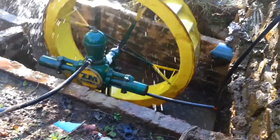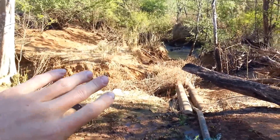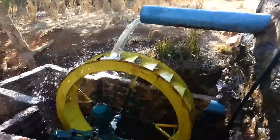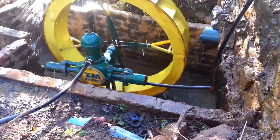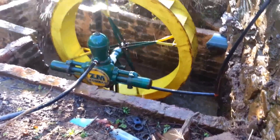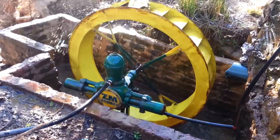Here is the ZM pump. I actually bought this very cheap from a guy who said it was broken, so I fixed it, and it's at the moment pumping with the ram pump. The pipe goes there and I'm going to show you the joint where the ram pump and the ZM pump meet together. It's similar to a wind pump — in this case it only uses two pistons, left and right. One sucks while the other one is pushing the water, and vice versa the whole time. It doesn't give me that much water; the ram pump is definitely the big brother here.